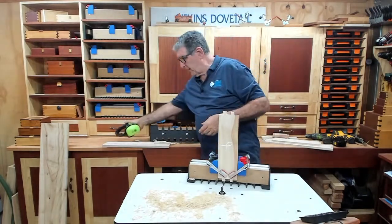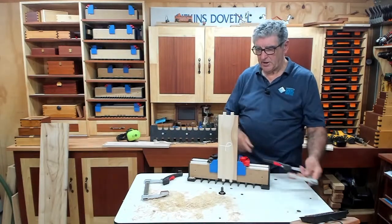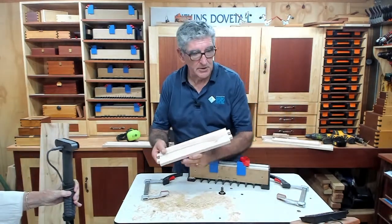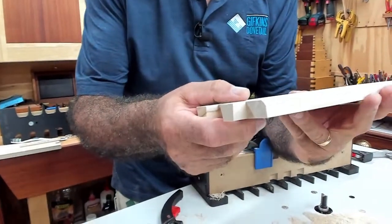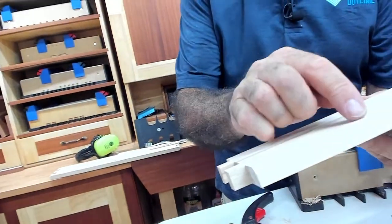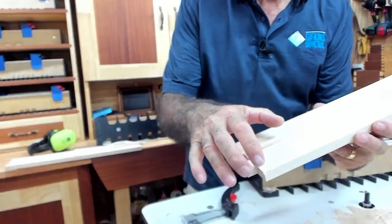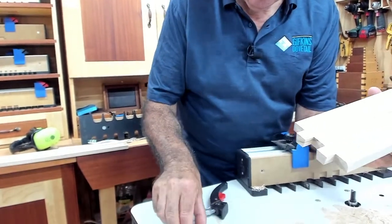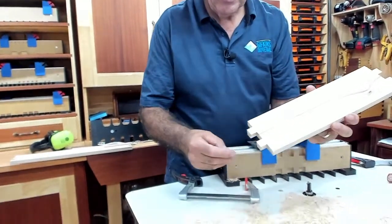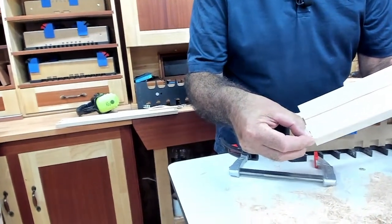Okay, now you may find, just want to show you this, at the right hand side of your cut, you may end up with a little chip out like this. Right? You can see a little chip out like that. The reason that this happened with this timber is because it's very, very flimsy along that edge, right? So it might mean that I have to do a little bit of repair. Okay, so it's not a big drama. It's on the back of the box, and there's my piece of timber that's come off there. So I'm just going to glue that back in place, and you won't even know